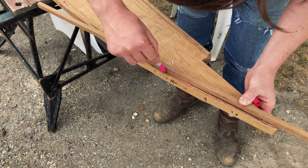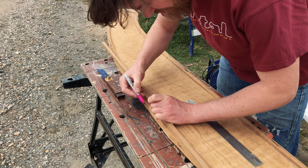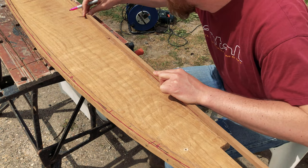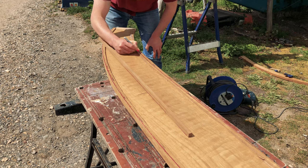I used a different piece of teak for the outboard end. It was exactly the same thickness as the overhang of the bullnose, so I could use this and carefully work it around the rebate to get that line. Here I'm using that same piece of teak just as a straight edge on the inboard end to thicken up the lines that I'm going to be working to.